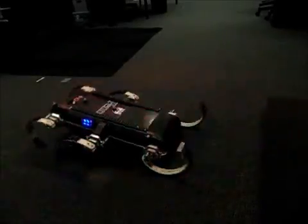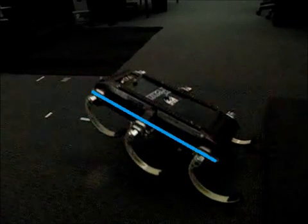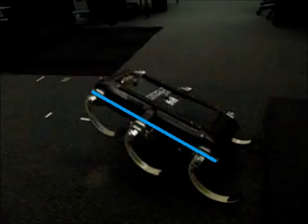Finally, the pitch of the robot can be slightly corrected in flight. The nearly massless legs can act as inertial tails, and so recirculating them by 360 degrees results in 14 degrees of body pitch correction. Both leaps were identical, and only the leg trajectory in flight has changed.